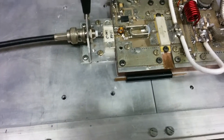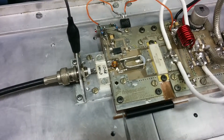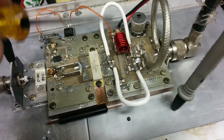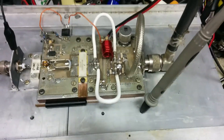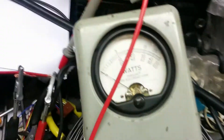I've added on today, being careful to note that the thing's on — the input attenuator is on. I rebuilt the whole balun bit, this bit here, with all the new ATC capacitors. It's going into a Bird through-line here with a wire over which I won't move.